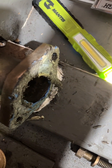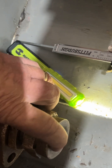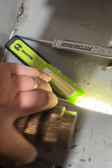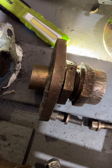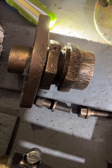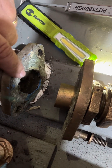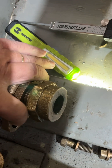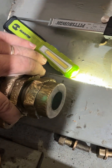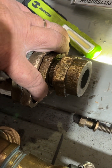Now what we had when we got it — which we assumed was right, we'd never seen it before but we assumed it was correct — we have what I believe to be a rudder port, where the flange just happens to be approximately the same size as the flange on the shaft log. The rudder port was put in, but the problem is it completely lost any semblance of self-alignment.